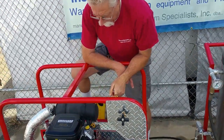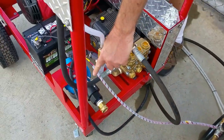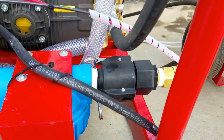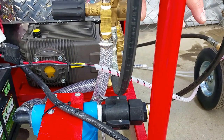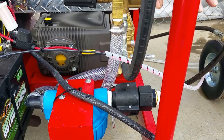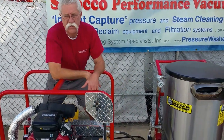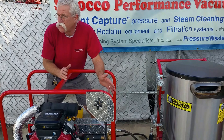The water supply comes in from a garden hose connection right here into that big filter. We've also added a cam lock coupling so you can take this off and put on a big feed line from a water tank feed application. You always want the pump to have an easy time drawing water. Even at a long distance, three-quarter inch hose is not that big for six-and-a-half gallons a minute over 150 to 200 feet. You should avoid going longer than 100 feet of hose at three-quarter inch with a machine like this. A perfect water supply gives this pump a chance to live a long time.